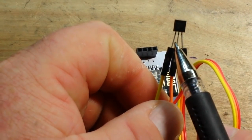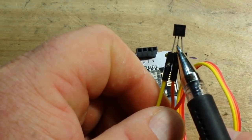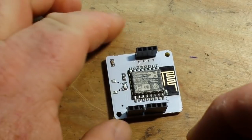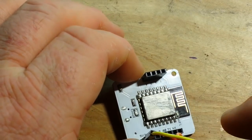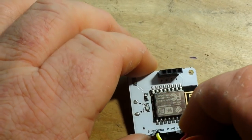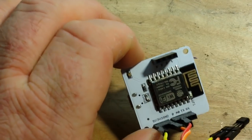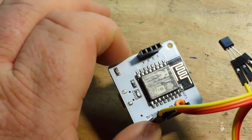Let's try and put together a little project. In the kit they sent this LM35 temperature sensor, which I've hooked up to some DuPont cables, and we're going to connect it up here and see if we can build ourselves a simple little temperature logger. Our pin out for this is VCC pin 1. Our voltage out — that's our temperature reading — is pin 2, and ground is pin 3. So yellow, our pin 1 is VCC and it says to plug that into our 5 volt pin. Next up is orange, which is our out — that needs to go to analog 0. And finally we have our ground pin, which goes to ground.